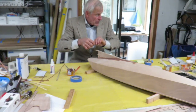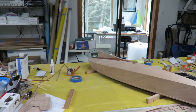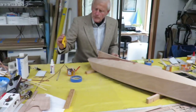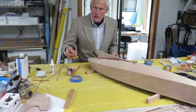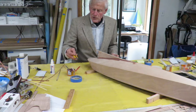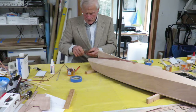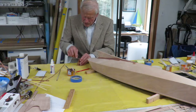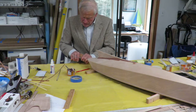There's a little epoxy up against the top of the rudder shaft. The best way to take that off is with a mat knife — this is the Olfa type, O-L-F-A. They're brilliant — much more control. You have this ratchet knob for adjusting the blade; it's also a break-off blade, but you can sharpen the blade instead of breaking it off and it lasts essentially forever. So we can just cut this off — we don't want to scar the shaft at all because we want it to spin easily.